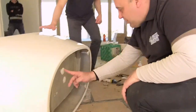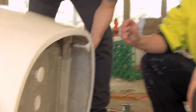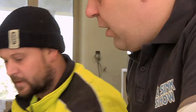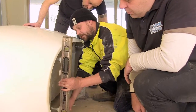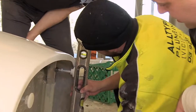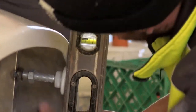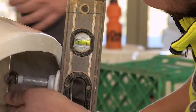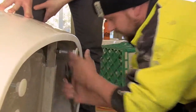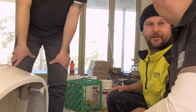We've got adjustable legs with a lock nut. I like to set them up three to four mil just off the ground, allowing you to get your silicone under there later. You get the level on it, keep it a couple of mil off either end of the bath. It's as simple as tightening it up to where it needs to come, then tighten your lock nut up with a shifter. Done — just on all four of them, and that'll generally keep it level, providing the floor is level.